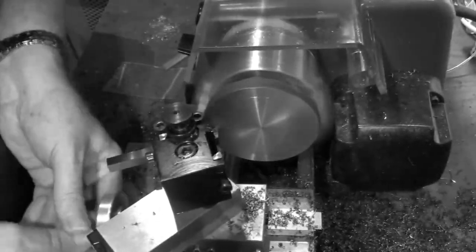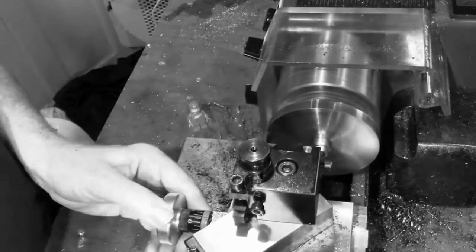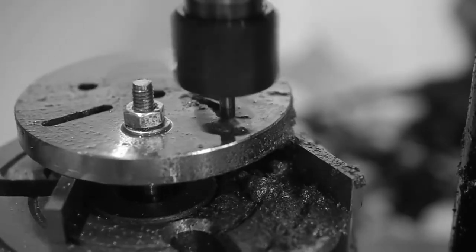The faceplate itself was machined from a piece of 42CrMo4, an engineering steel similar to 4140. The slots in the face were the most difficult operations and the source of most of the mistakes. Fortunately, I was able to recover by adapting the design a little.